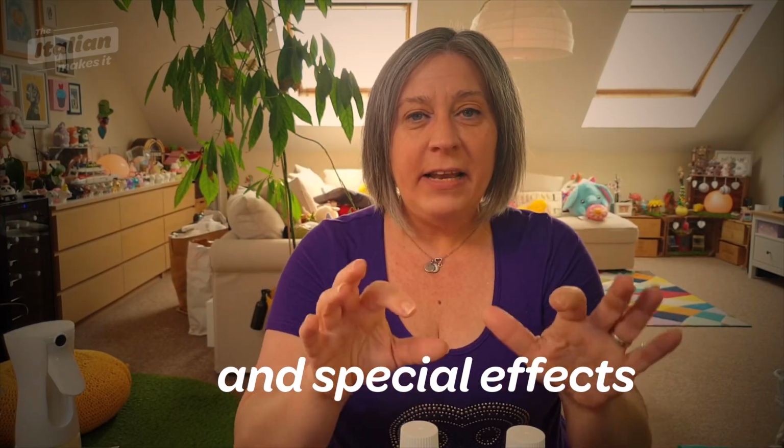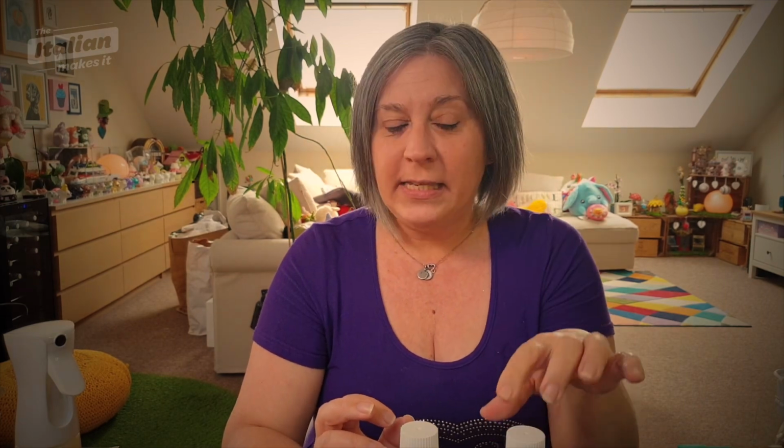And when I was reading the front bit, it just made me laugh. Because of all the things that inhibit the curing of this silicone, one of them is epoxy resin, fair enough, and also plasticine, but there's also garlic and onion. That made me laugh. But this kind of silicone is used to make prosthetic arms, or like, you know, the fake dolls and that kind of thing. And apparently it has got the squidginess of your earlobe. So we'll see how squidgy the elephant is going to get, as it's compact. I am very excited about this.